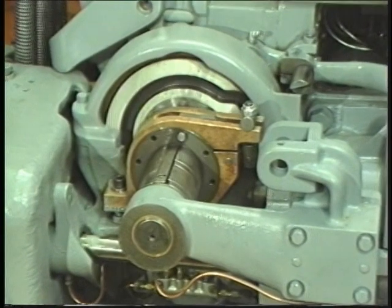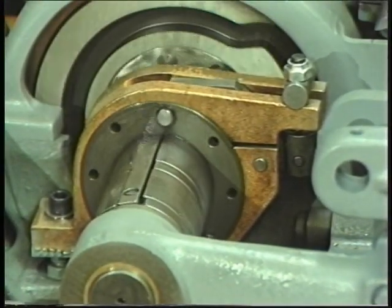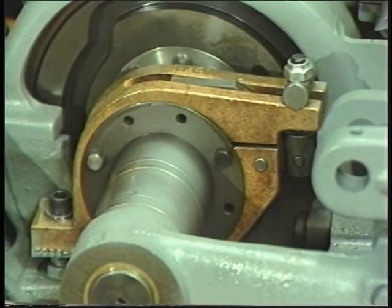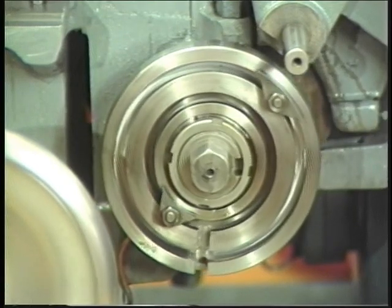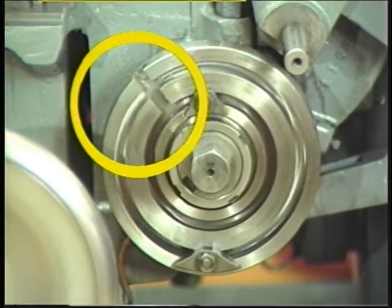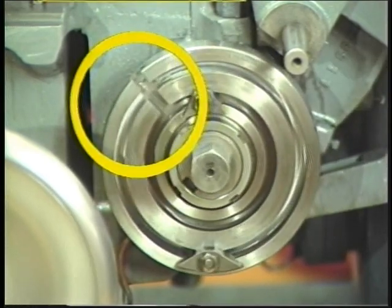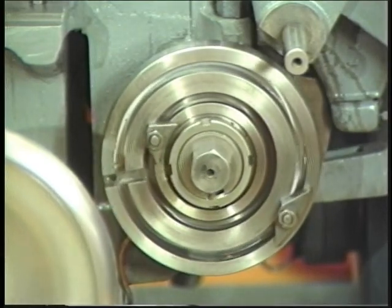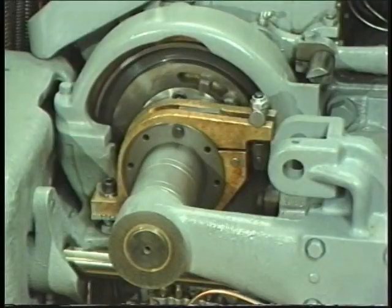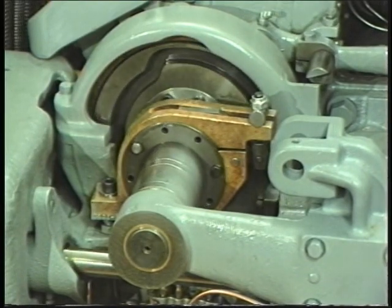The brake. After starting the machine, but before making work pieces, check the brake to be sure it is not slipping. An easy way to check the brake is to watch the slide on the burring spindle opening and closing cam. If the brake is slipping, the machine will not operate at a consistent rate of speed and the slot will appear to jump. If the brake is slipping, the proper adjustment should be made before you start making work pieces.